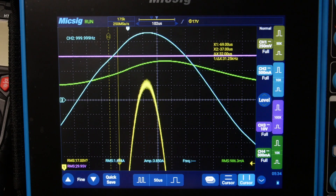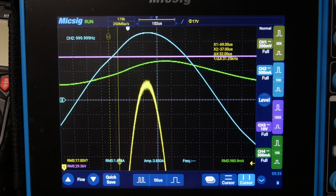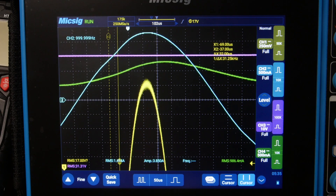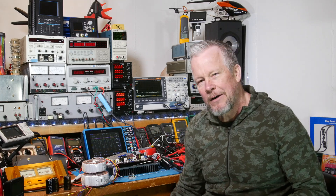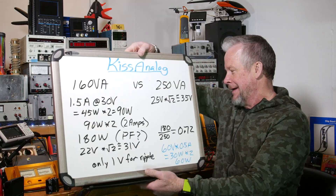At 29 volts the THD is 0.04%, and taking it all the way up, THD is still 0.04% — a very minute change. 0.05% is the next step up, so the change is tiny. I'd say around 30 volts to be safe — we'd want the voltage rails to stay above plus/minus 30 volts. It looks like we need 29 volts before we start affecting THD, and I had about 1.4 amps per rail, so call that 1.5 amps.